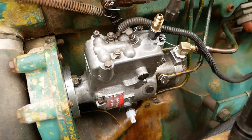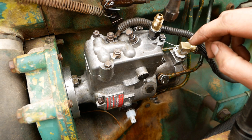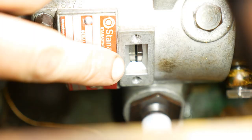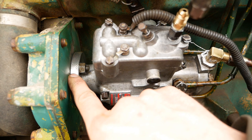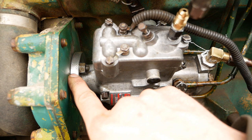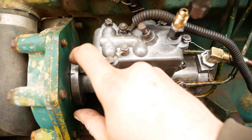A few people wanted to know how to time the injection pump, so I'll show you how it works on this engine. Down here on the side of the injection pump is a timing window. This pump only has one timing window - some Stanadyne pumps have one on either side. Inside the timing window there are two timing marks: one is on the cam ring - that one's more or less fixed, it only changes with the timing advance inside the pump. The second timing mark is on the weight basket, so that one rotates with the input shaft of the pump. You want to line those two up. In this particular application, someone has already marked the housing in the back of the timing cover, so if we remove the pump and reinstall it and line up these marks, the timing should not change. If we line these marks up, the timing inside the pump can't change.